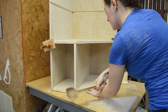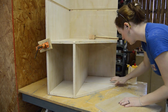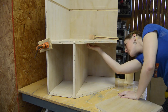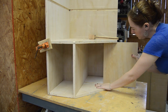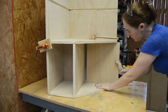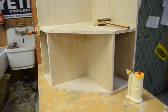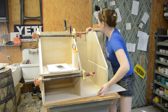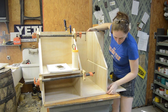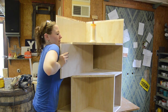I came back with a long solid piece then finished it off with a second short piece. Even though I'm not stating it every time, all of these joints do have glue on them. I repeated the steps and built it up layer by layer, making sure to pause after each layer to clamp it and allow the glue to dry.